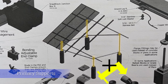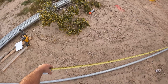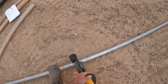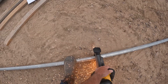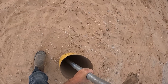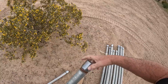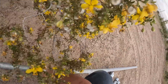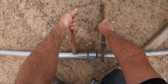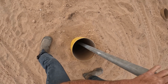We've got three posts in front and three in the rear — six total. The kit included the panels, micro inverters, all the hardware, and wiring inside the boxes. The only thing not included is the pipe. I'm using galvanized inch-and-a-half schedule 40 pipe, threaded on each end, in 21-foot lengths. You need 23 feet for the two horizontal bars — top and bottom — connecting the three uprights, so you need a threaded coupling. I left threads on the ends so I can extend and add more panels later if I want.